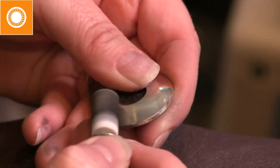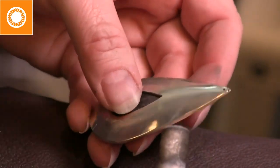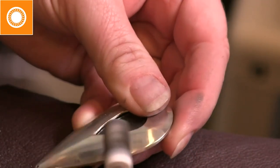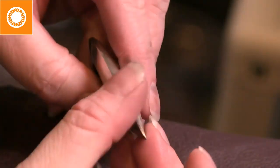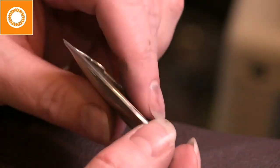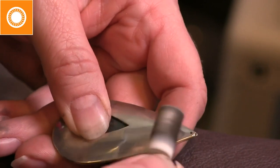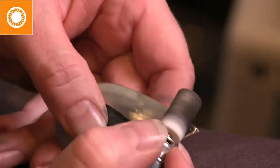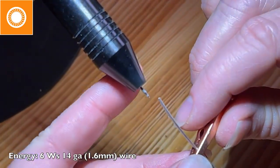I'm going to go over the back with the felt to remove any small surface scratches, then move it over to a high finish with red rouge. If you're going to do any polishing steps, make certain you clean your piece really well between steps because you don't want to cross-contaminate the different grits. If you have 180 grit and leave some of those particles on there, even going to a 3000 grit paper is going to be compromised.